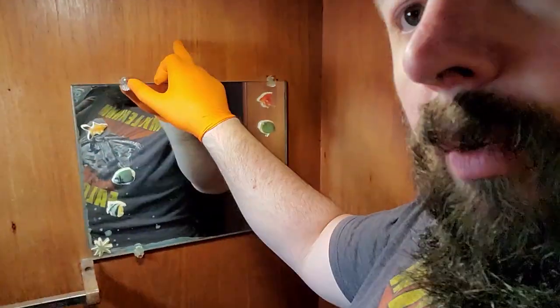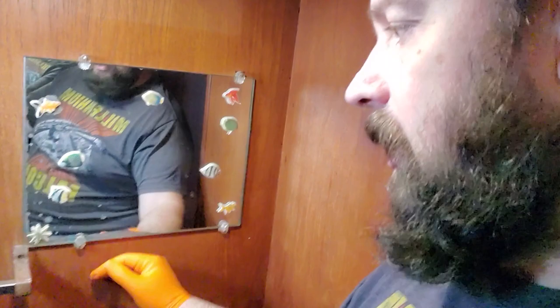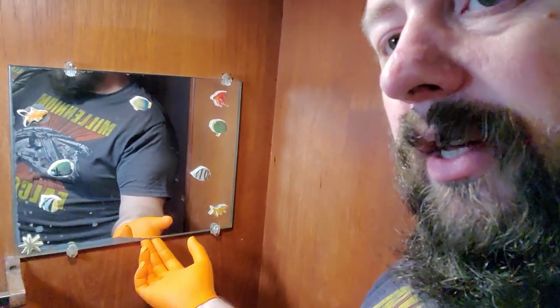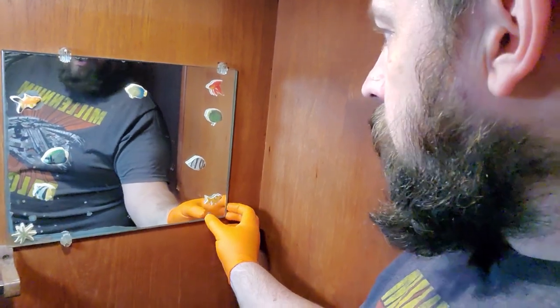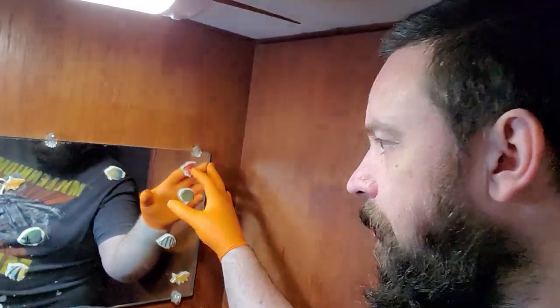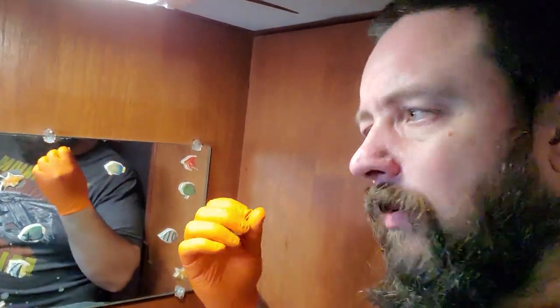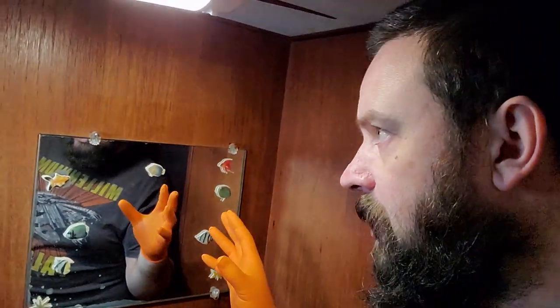This mirror here is going to go away, and there will be another one that gets mounted on over here, and I have to think about the mount for that. So I'm probably going to encapsulate the mirror mount on this side into the fiberglass somehow. I mean, you've got these little holders on the side, maybe something like that. We need to make sure whatever I put in here, though, that it's going to be waterproof. So maybe I'll be mounting it up with some of that 3M vinyl adhesive or butyl adhesive tape. That stuff's pretty good. Few things to figure out there.